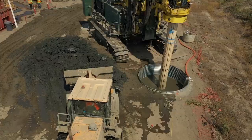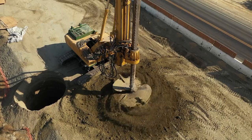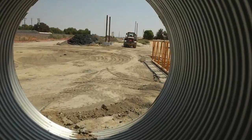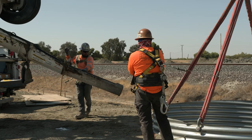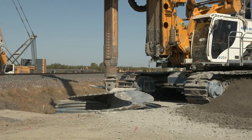The process starts with drilling a 13-foot diameter hole anywhere from 25 to 40 feet deep to get the can set. We have to support it, then backfill it with about 30 cubic yards of 4-sack slurry, which secures the can and forms a plug at the bottom. After that sets up, we come back and backfill around the edge of the can with an 8-sack grout mix, and once that's set we go down and start drilling the actual pile.